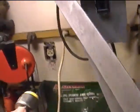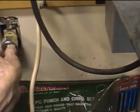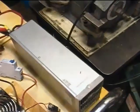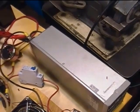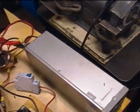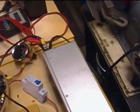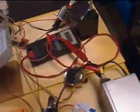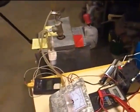Okay, we'll power the thing up here, and you'll notice it takes 4 seconds before we hear the power supply start to make noise. It's a switch mode power supply, so it knows enough not to put anything on the output lines until it's up to voltage. And then the last thing we have to do to prepare for operation is to turn on the radiator cooling fan, and I'll do that here. And you can see that it's a pretty loud fan.